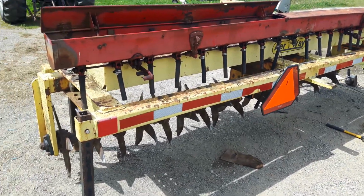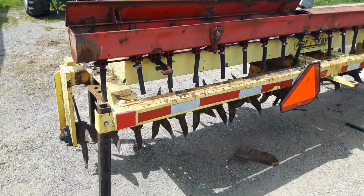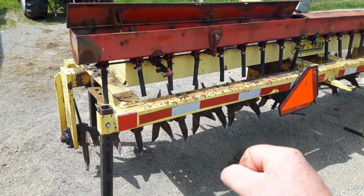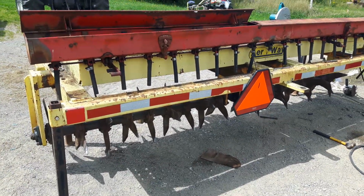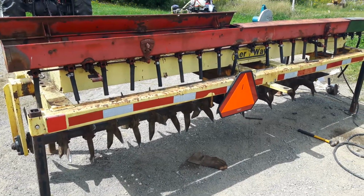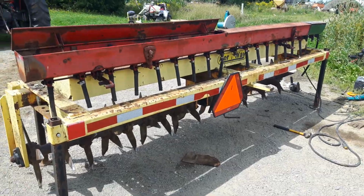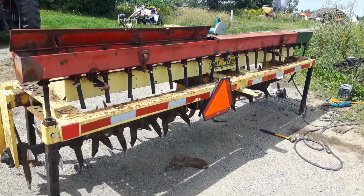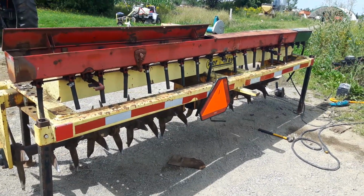So you put it behind the blades so it pokes the holes, and if you had it in front, of course, it would drive it down into the ground too deep. This way, it would just kind of sprinkle it onto the openings. If I need it a little more aggressive, I angle the blades, and right now, of course, we're just running straight. But it's something I've been going to do for quite some time. At least this way you're doing 2 things at once: you're aerating, and then you're putting seed down. If I don't want to put seed on it, you just don't run it.